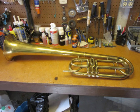I want to make sure I leave plenty of room around the instrument in those areas, between those and the case wall, because if the instrument touches the case wall and the case is subjected to shock, that's passed directly into the instrument, possibly damaging it. You always want to have some air space, or at least padding, between any part of the instrument and the case. And I also have to take into account the thickness of the pine stringers, because those reduce the size of the case in some areas.